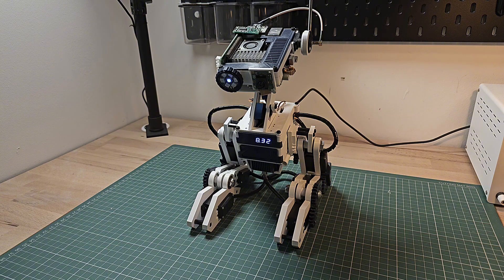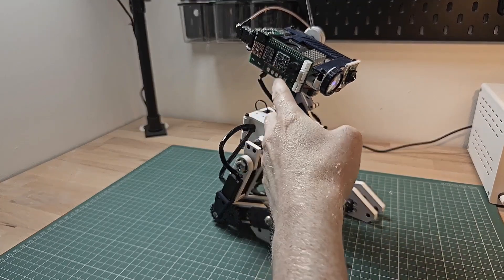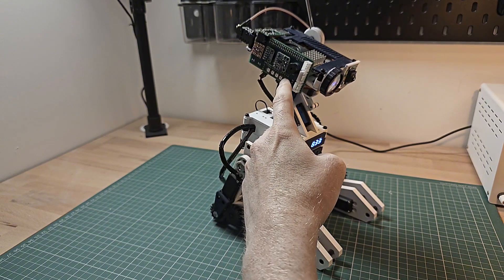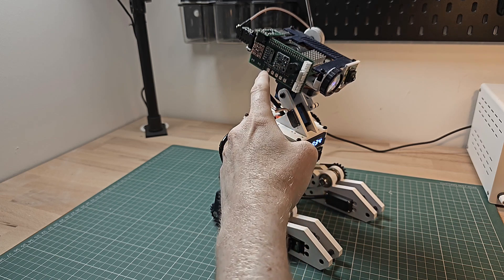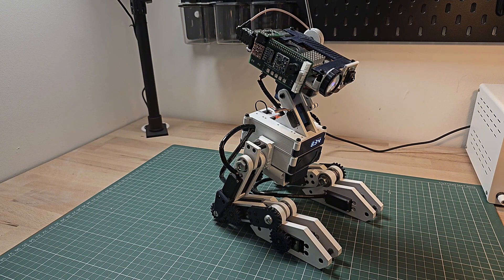You can see that moves quite slowly — the speeds and adjustments can all be made in animation files specific to the project. You'll also notice that the eye is lit up with a blue LED. That's the NeoPixel module. There is an I2C board hidden behind the main PCB that controls the NeoPixels not only on the eye but also on this custom PCB we've manufactured. These LEDs are designed to be status LEDs — depending on which modules you have running, you can create your own debug output based on color, intensity, or pulsing, to understand what's happening in the brain of your robot without checking the debug logs.